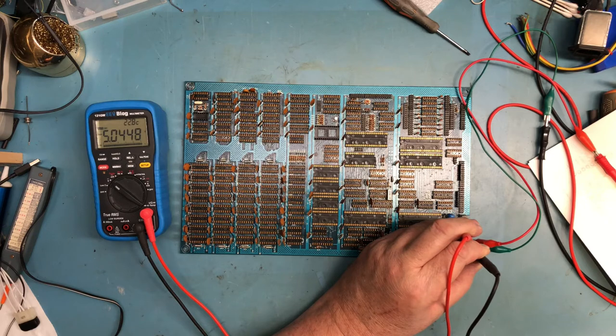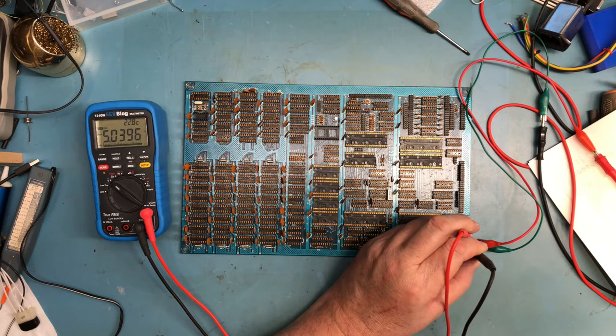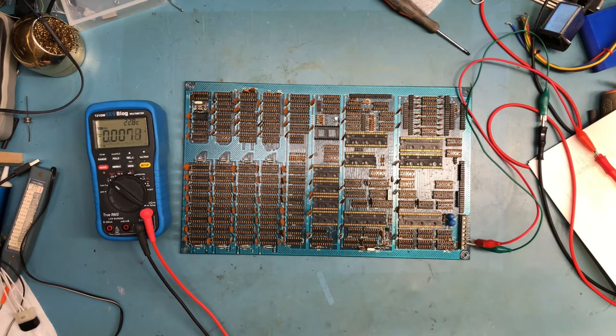so why is that switcher blowing the fuse? Absolutely no issue here. Seeing any issue. Power supply certainly not in compliance. I want to get back to voltage control. And 5.3 volts is as high as I can go. It's still drawing 10 milliamps or so, which surprises me. There may be some active circuitry here I'm just not aware of.